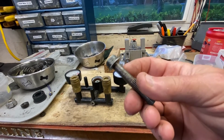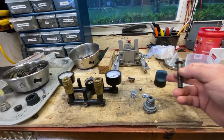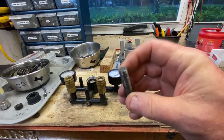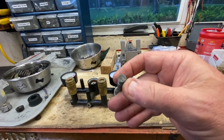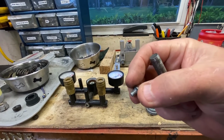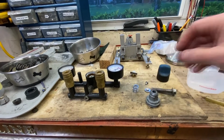Then we'll make a companion end, probably with the knurling tool in the lathe, that'll go inside there, and we'll glue it in at the proper length. One of the operations, we'll have to drill and tap for this thread here for this little one, which I haven't measured yet, but I would assume this is probably M5. So anyway, let's get started.